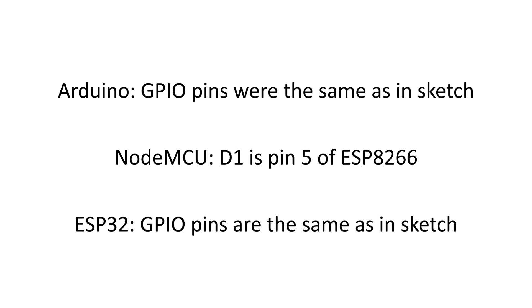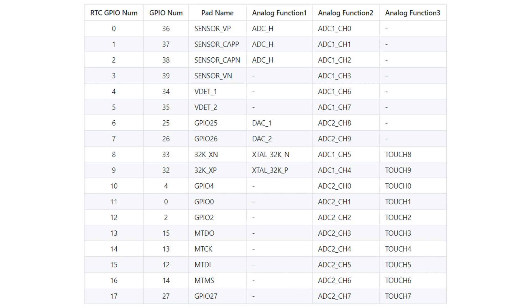Unfortunately, not so for the ULP. Here, GPIO 27 is ULP GPIO 17. And not enough — sometimes you have to use touchpad 7 for the same pin. Extremely nerdy. The chance you get it right the first time is pretty small and the time you can spend searching for an error can be long. The only explanation I have is they wanted to give us the most playtime per dollar.